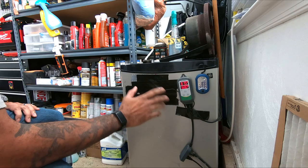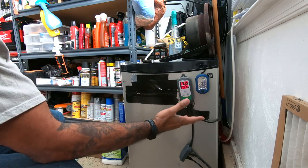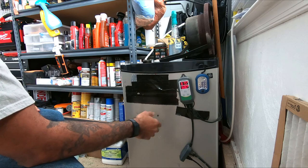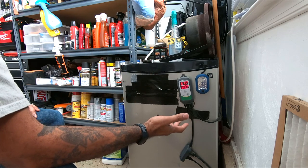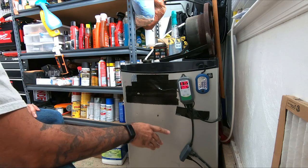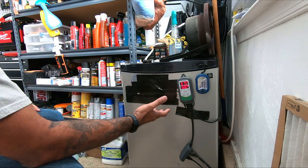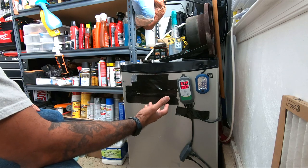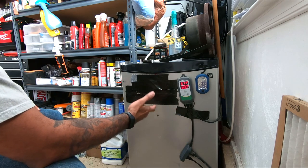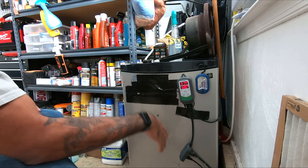Something to keep in mind is that I've noticed with this unit and my particular setup it'll start to yo-yo. Say you have both differentials set to one degree and your set point is 70°F — if it drops below 69 it kicks on the heat, if it goes above 71 it kicks on the cool. The problem is it's always going to be yo-yoing. The heat lamp runs until it hits 70, cuts off, but that element is still hot so temperature keeps rising past 71, kicking on the cooling side. Once it drops back to 70 the cooling cuts off, but that panel is still cold so temperature keeps dropping, and you end up with constant cycling between heat and cool.